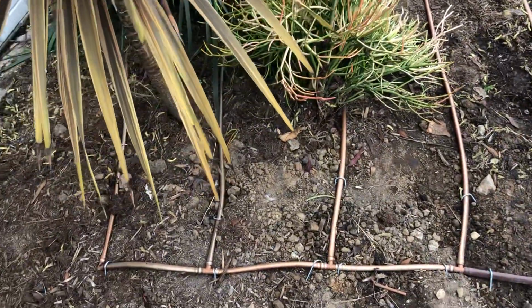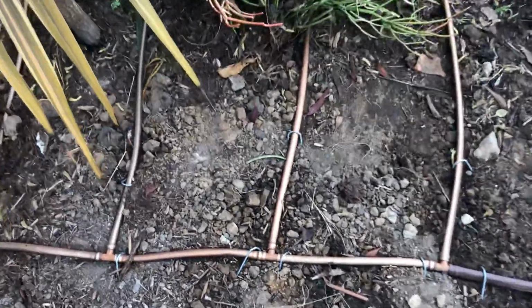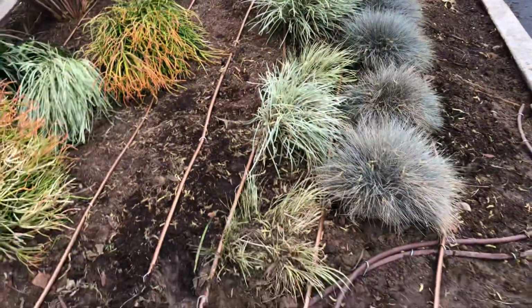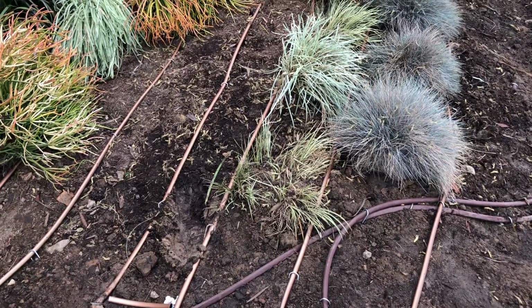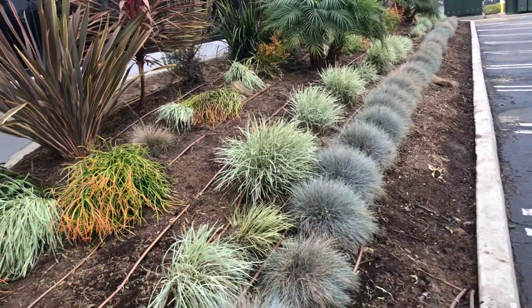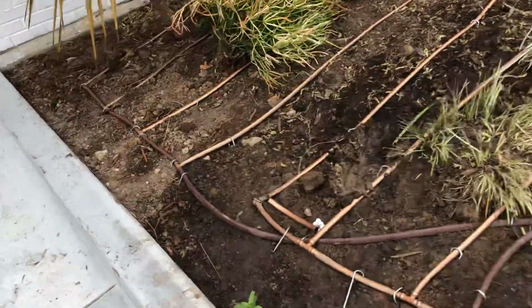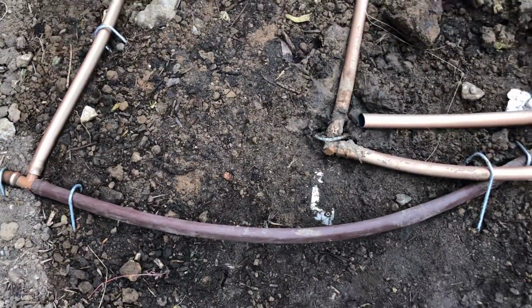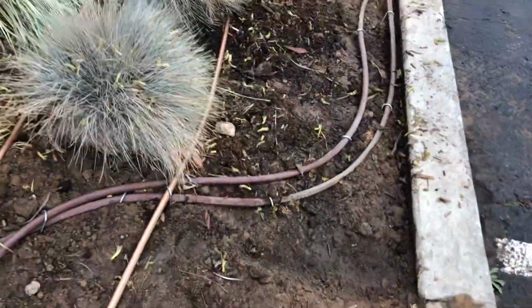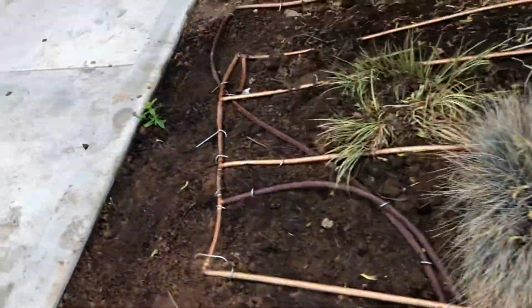So when you do a drip irrigation, you're supposed to build a grid. Every 12 inches, there's a T that's put in this lateral line, and then we just shoot it out across. Now, with the Rainbird Copper Shield drip, that's what we have here, you can only get about 330, 340 feet before it starts acting improperly, where it won't water uniformly. And water uniformity is really the key to drip irrigation. The dark color here, that's actually blank tubing. You can see there's blank tubing that comes out from the valve, and then it shoots out into the drip where we want to get drip in.